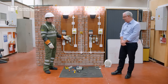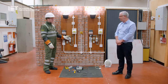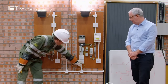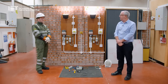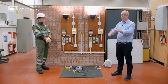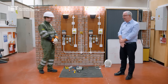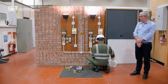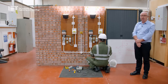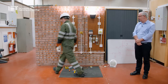As part of the demonstration, we'll also break the main neutral just for a brief demonstration. You'll notice a slight dip in the lights, but it's a balanced load at the moment — two light fittings acting as load — so it's effectively working without a neutral conductor at all. We can very quickly introduce additional load into the circuit via the small heater. Keep your eye on the lights: the minute we unbalance the load, you'll see the voltage increasing dramatically near one property, which is in line with what we'd expect to happen.